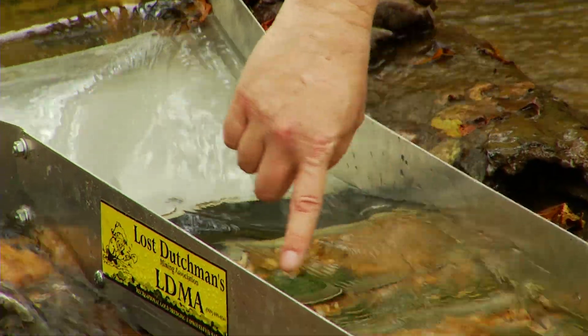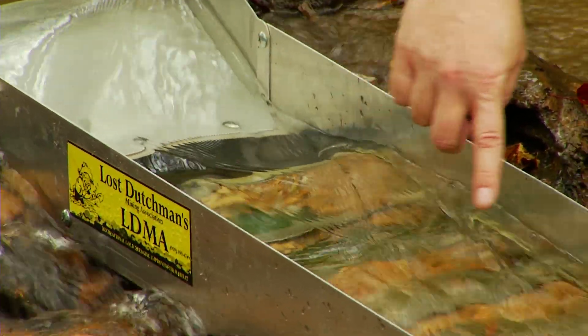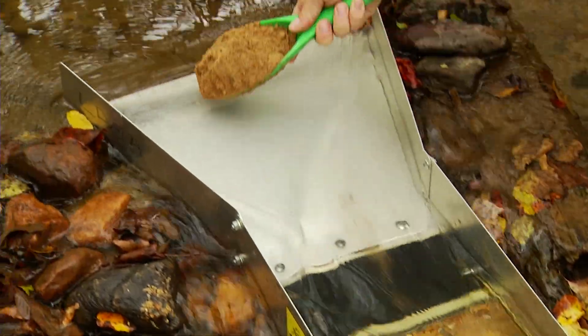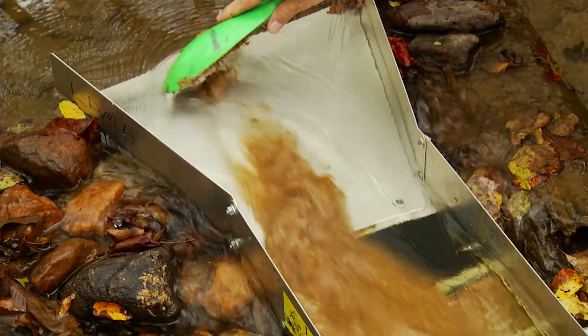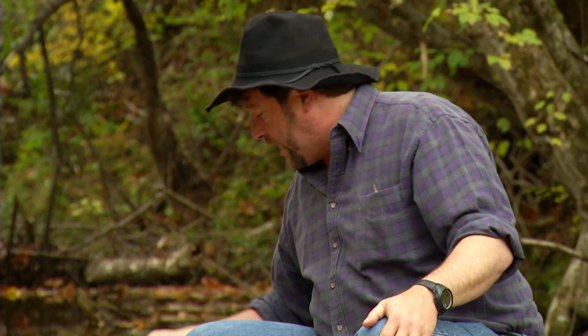You can see how this material is hanging in here behind this eddy that's right behind these riffles — that's what you want to see. You let the water wash the light stuff off, and your box is trapping your heavies in there. I like to just put some of the material inside the box, and if it blows on out of there, then you know you've got too much water flow or you've got it too steep.